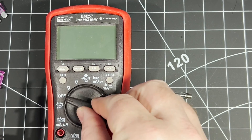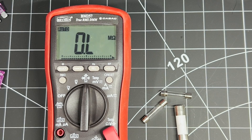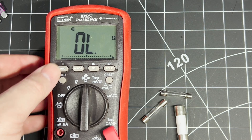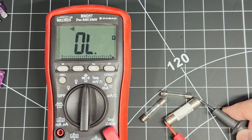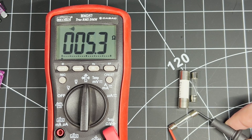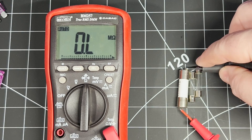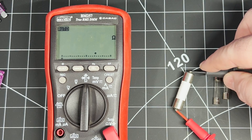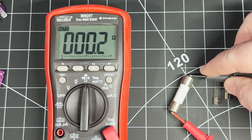If you're dealing with non-glass cartridge fuses and so you can't easily determine whether it's blown or not, you can simply use your multimeter in the continuity mode. We just attach the probes to either end of the fuse, which allows the multimeter to determine whether there is continuity through the fuse. If the multimeter gives us a large resistance or gives an error message then the fuse has most likely blown. You can also test your fuse using the ohmmeter setting on the multimeter to check the resistance of the fuse. First we want to remove the fuse from the circuit and place the probes on each end. A lower reading close to zero suggests that the circuit is continuous and the fuse is functioning as expected.